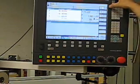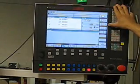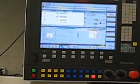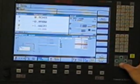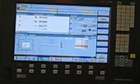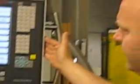I'm going to select that. Then it asks: what is my part — is it rectangular or circular, or am I looking between bosses? In this case it's a rectangular part, so I select it. Now it's a matter of filling out five variables: what work coordinate I'd like to use — I'm going to say work coordinate number two — the overall rough size of my stock, how far down I'll allow the probe to go before it hits the edge, and what I want to call the center of the part when done — zero-zero, or three inches over from an edge, whatever.